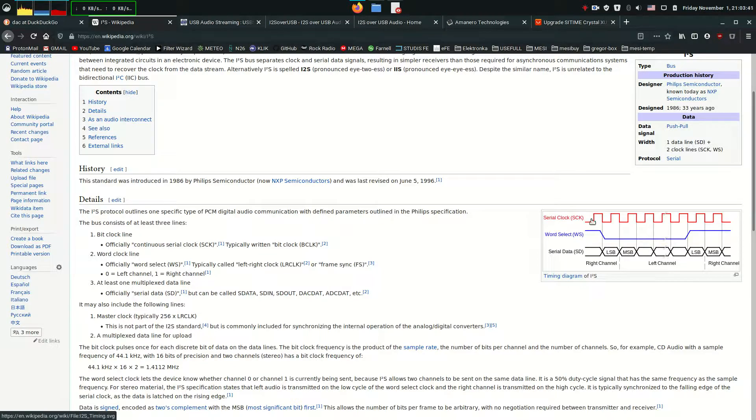There's often another line called the master clock, which is much faster than the serial clock. It gives the clock for the DAC to operate and it's going to be way faster than the serial clock. For example, if the audio is sampled at 48 kHz, the master clock could be working at megahertz or more. This is oversampling — it makes the DAC actually do its job, while the serial clock is just for interpreting and synchronizing the input data.